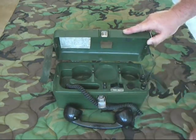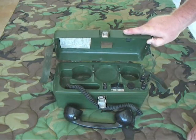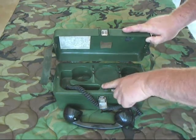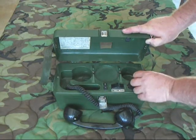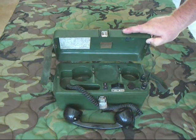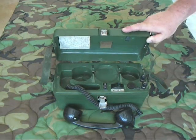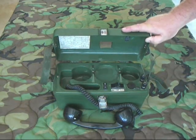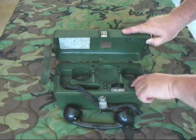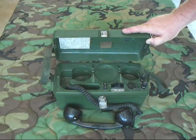These points right here were for telephone maintenance guys to connect and inject a tone on a line. The binding post is right here, and this cutout right here was for a dial unit that could be fitted inside. If you're connected to a common battery automatic switchboard and wanted to make dial phone calls, you could plug a dial unit in there and make dial phone calls.